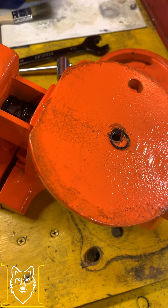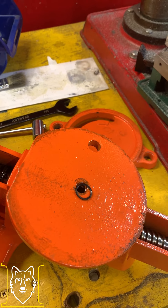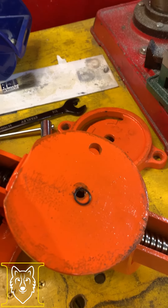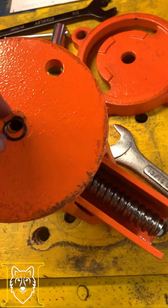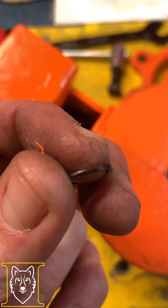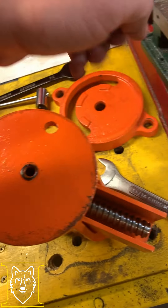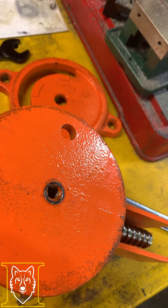I'll try and see if this washer fix works first, but I almost like the direct-mount idea better because I don't like swivel bases - I think they're a weak component. Who ever really swivels a vise? You can see that little dinky thing - is that even a spring washer? It's just been beat up and bent, so it just looks like it was a spring washer. My idea was to just throw another washer on this to try and seal that gap up and see what that does.